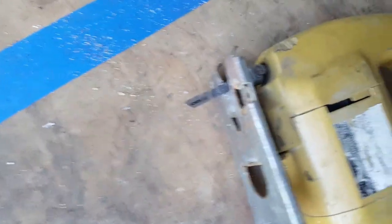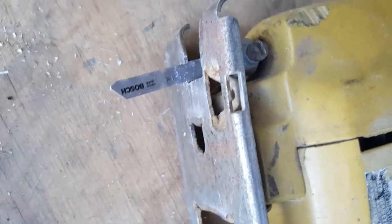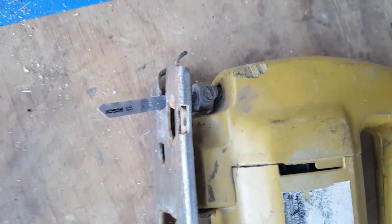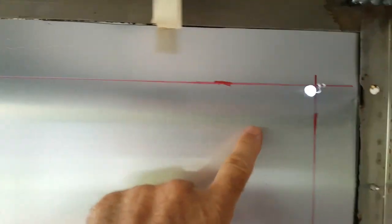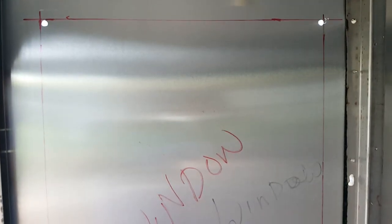This is the tool I'm going to use to cut the rectangles — I'm using some Bosch blades with a very fine blade made for cutting sheet aluminum. I bought these at Lowe's, about five for five bucks on sale. To cut the rectangle you first need a pilot hole for the blade to fit into, so I drilled a 3/8-inch hole in each corner to get started. When I cut, I'll cut the most floppy part first — if I leave it last it'll give me vibration problems.